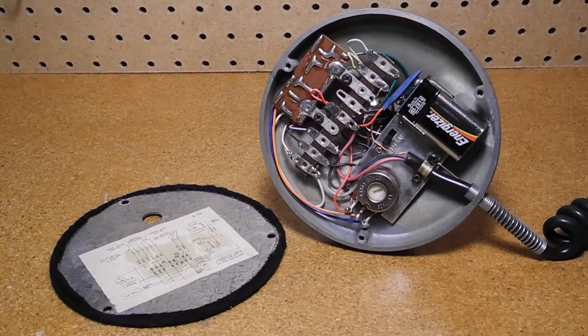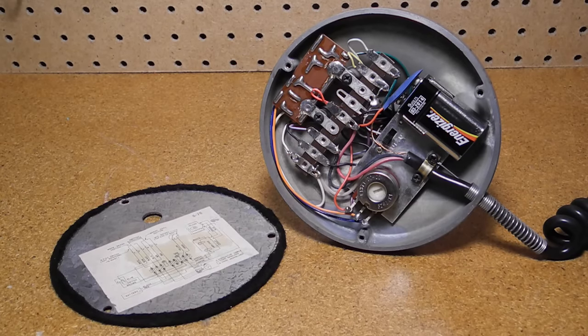The T-UG-8 model of stand includes a two-transistor solid-state amplifier circuit with adjustable gain, operated on a 9-volt battery. Battery life is estimated at about 6 months. A switch selects between two different modes for the press-to-talk switching function, referred to as electronic and relay modes. Relay mode connects two wires, and electronic mode grounds a wire.